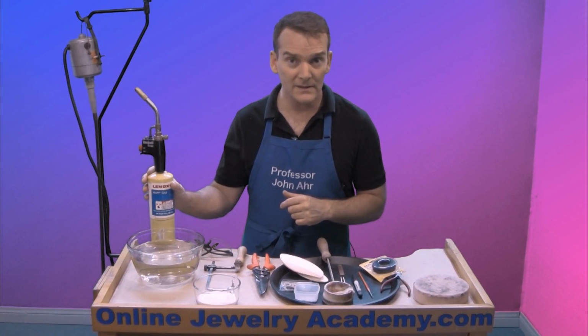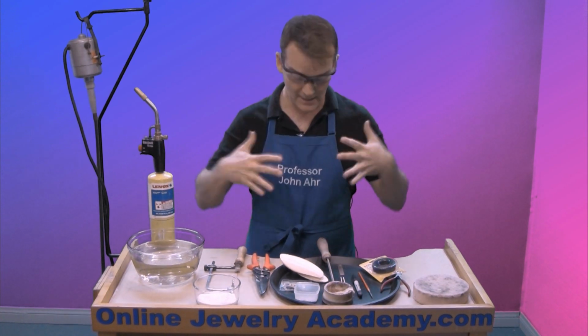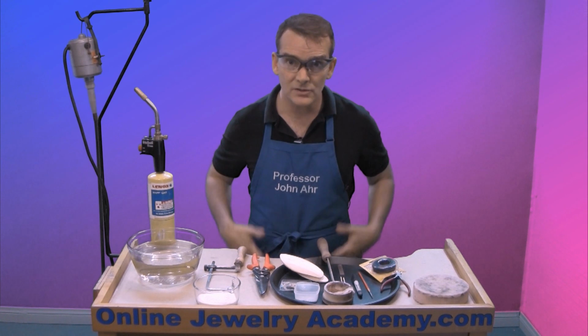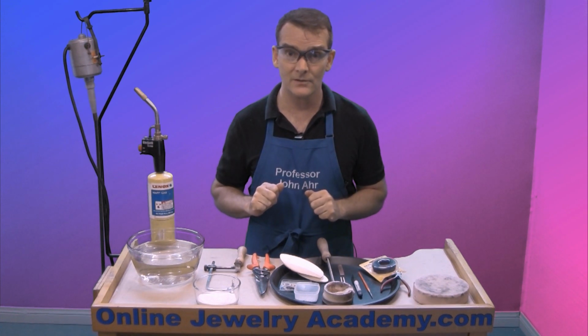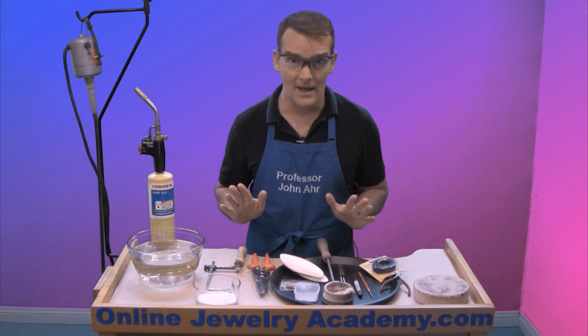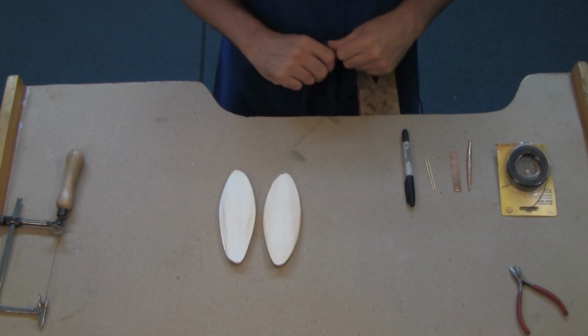And last but not least, don't forget your safety glasses, that and an apron. You want to protect your eyes, you want to protect your body, and for goodness sake, don't sit down while you heat the material. You could end up with a lap of molten metal, and you don't want that. I've laid out the things that we need in order to set up for cuttlefish casting.